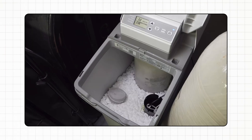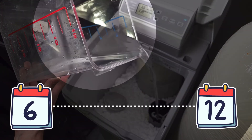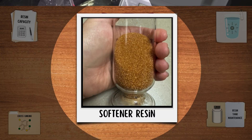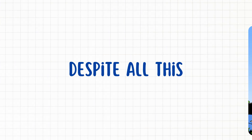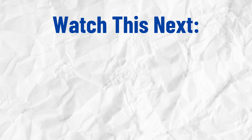Finally, clean your resin bed with resin cleaners every 6 to 12 months to help prevent iron and organics buildup. And you'll be good to go. Despite all this, your resin will expire one day. But how can you test if it has actually gone bad? Watch this video to know it all.